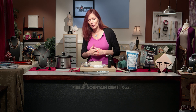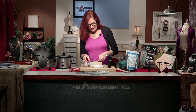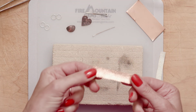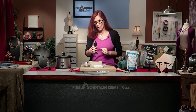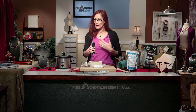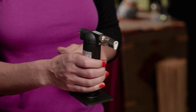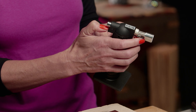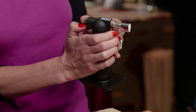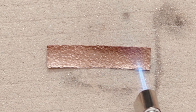So let's show you what pickle looks like and a couple of tips you need to know when you work with it. This piece has been work hardened and I'm just going to bring it to an annealed or soft state again. I'm turning on my torch — I'm standing well behind it. You should pull back loose hair and clothing. I'm in the habit of always working behind my torch at an angle away from me. So we're just going to ignite it first. I'm going to heat this and chase the heat until I get it to an annealed state, and you'll see it turn nice and black.